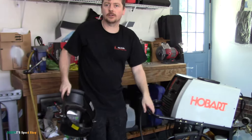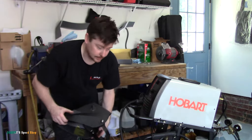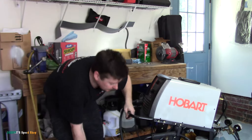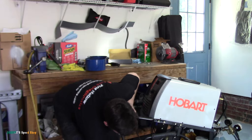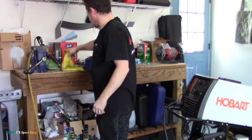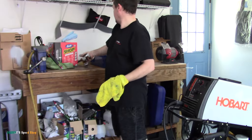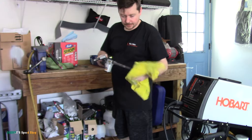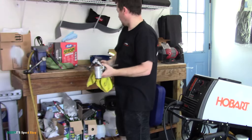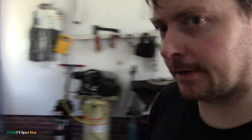The welder I have is a Hobart 140 — it's a 110-volt welder. It'll do up to about a quarter inch metal, although a quarter inch is pretty thick. But for what I do, like repairing cars and stuff, it's perfect — it is all you need. Plus I don't have 240 volts in the garage, although I want it because I want to get an 80-gallon air compressor. You want to be careful cleaning it up too — you can put heat into it just grinding that metal back, enough heat to warp it again.